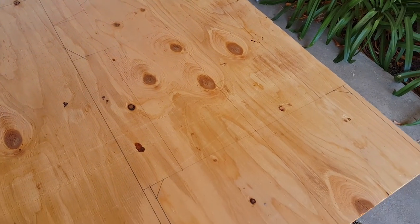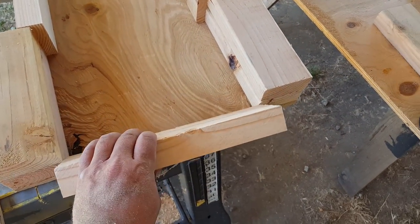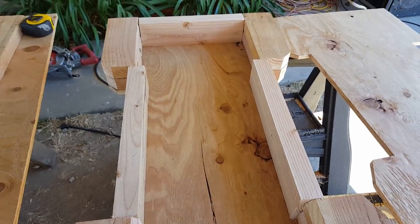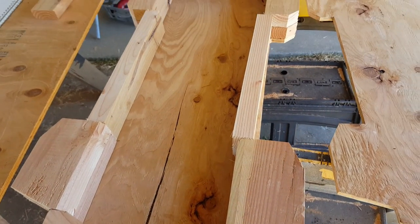Gina and I drew one side of the tombstone, then I used a skill saw or jigsaw to cut it out, sanded the edges, set it back down on the sheet of plywood, traced around it, and then we had our back side. We sandwiched the two pieces of plywood over two-by-six and two-by-four scrap to achieve the desired thickness of each tombstone. I cut the two-by-fours down for nice straight corners, and used two-by-sixes in areas where we'd be putting angles or routing the edges — giving it enough thickness so that cutting material away wouldn't go through a two-by-four.